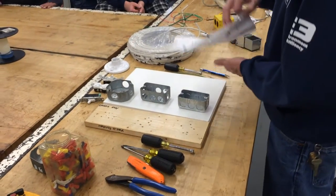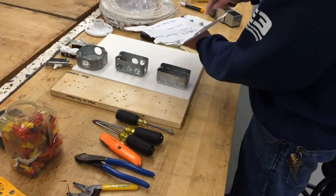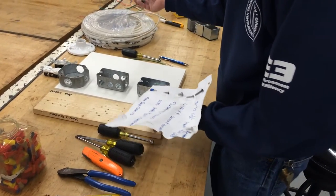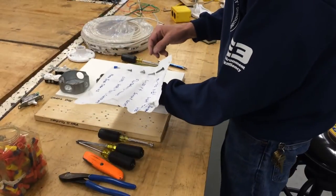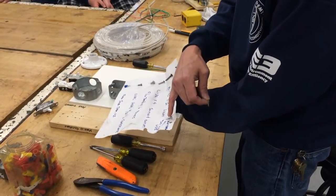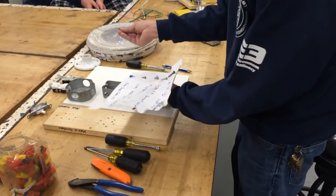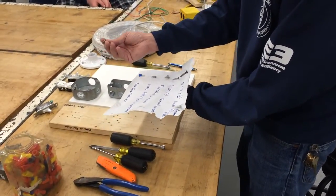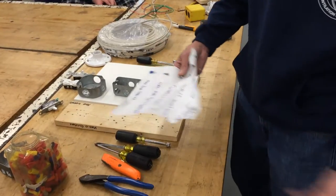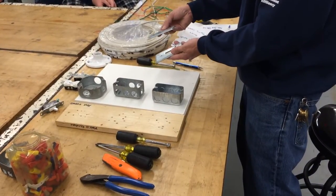You're going to need two 8-32 screws — that puts the light fixture on the fixture box. You'll need four 6-32 screws for the switches and plugs; normally they come on a new switch but since these have been used you'll have to dig around for them. You'll need six 5/16 screws — not the tapping ones with the AB point tip. We want a standard point with the 5/16 head; use Phillips not flat. You'll also need oval head 6-32 by half-inch screws for the cover plates.